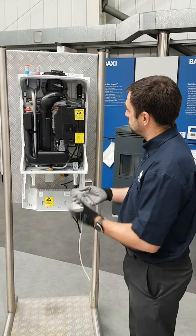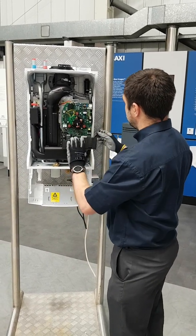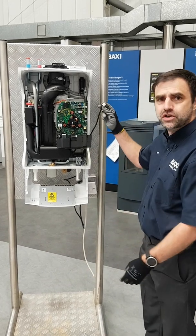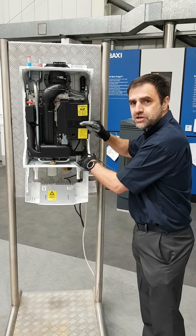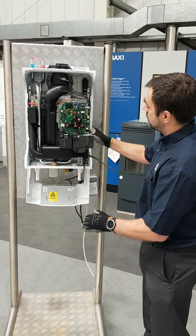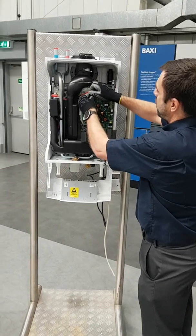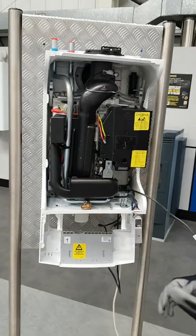So if you're going to do a full strip service, quite simply remove the connections from the board. These are the bus connections and the controls at the front. Then you have your switch live neutral and earth. Down the bottom here you've got terminals where you can do your basic electrical safety checks. You've also got your controls wiring, your earth and your spark. All these are easy fit connections and you can't get them in the wrong place.